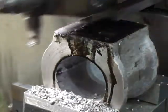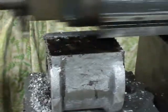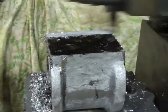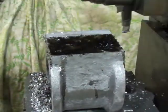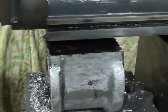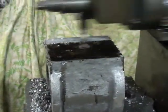It is hard. This bit here is designed for cast iron. I put this one in because it was the only thing that I had that would cut okay — I didn't want to resharpen everything again and again. This one is a little harder steel; I think it's M42 cobalt high speed steel. If it takes and dulls this one out, I'm just grabbing a carbide insert holder and putting it in there.